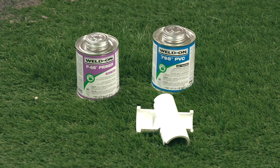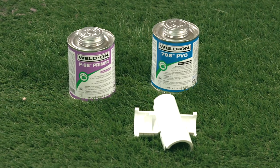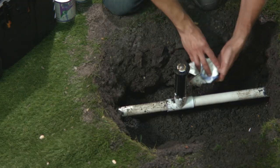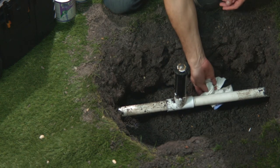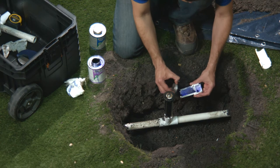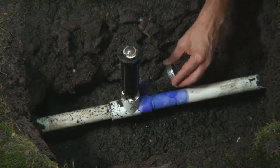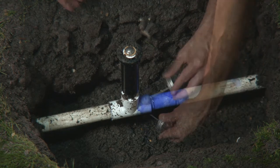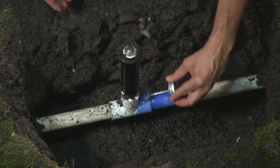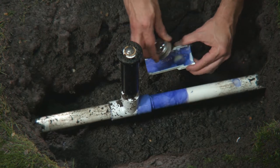For this repair you will need the Snapper Pipe T or 90° repair kit, PVC primer, and cement. First, dry and clean the broken area of the pipe. Open up the snapper repair kit. Apply primer to the broken portion of pipe and fixture just where the repair kit will go. Now apply quite a substantial amount of PVC cement on the pipe and fixture and on the inside of the snapper.